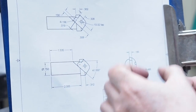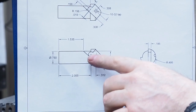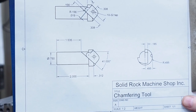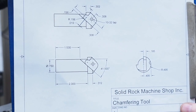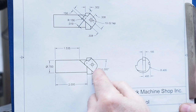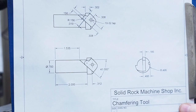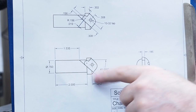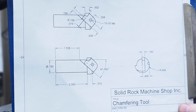What you have here, because I was cutting this in a V-block, and my V-block is kind of thick, I used the best end mill I had at the time, and it was like a 5/16, and all that is doing is providing a relief. When the square insert is sitting there, it's providing a relief so that you're not hitting that back corner. And if you got the reach and you got the tools, you can do an 1/8 inch end mill, you can do a 1/4 inch end mill. But the length that I had to reach was quite long, so I just went with the 5/16, and all I need is something that will stop in two directions.